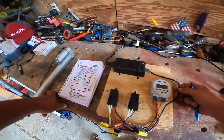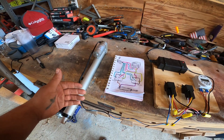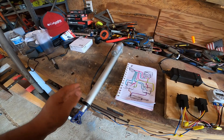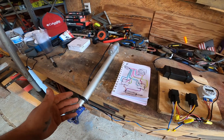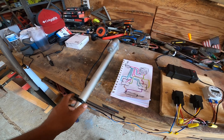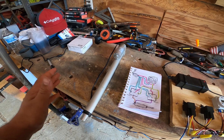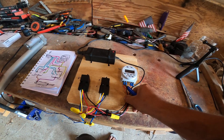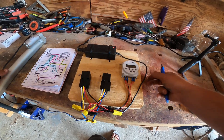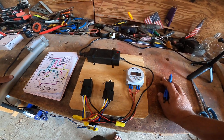I'm going to add a fuse shortly. If this actuator is opening or closing a door and something gets hung up in it — in my case, a chicken — that chicken is going to feel it because this thing pushes like 200 pounds. If it's really putting the load out, it may draw 10 or even 30 amps, and in that case it'll heat up the wires and possibly melt them or catch fire. So put a fuse on here rated at whatever your power supply is rated at. This one's 5 amps, so I'll put a 5 amp fuse on.